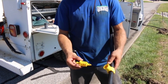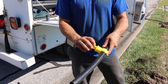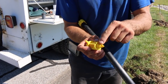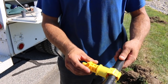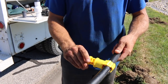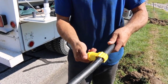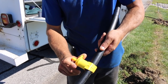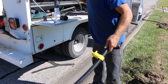Once you've got that on there, you've got this piece, and this piece will screw in here and will actually puncture the poly pipe, and then the water comes right through the bottom of this. This will puncture and go into the pipe — this is how the water exits the pipe and gets into the head. You put this in here, keep screwing, and you'll feel it kind of bottom out or click into place, and then it won't go anymore. Once it hits that, you know you're good.